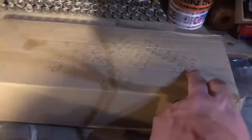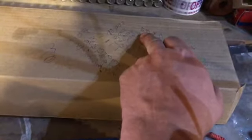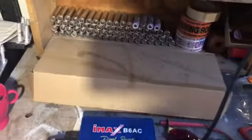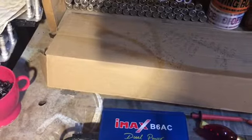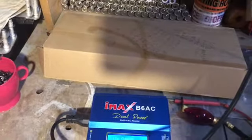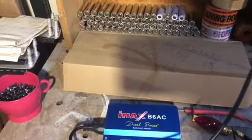Then I charged them back up — from 3.25V up to 4.07V. So they're taking a charge right up to about four volts even. The full range was 3.93V down to 3.25V, which is still just a tiny bit low, but that's 40 amp hours of drain out of each one.